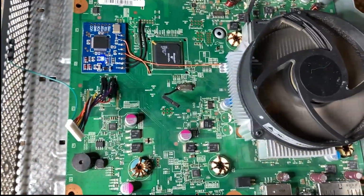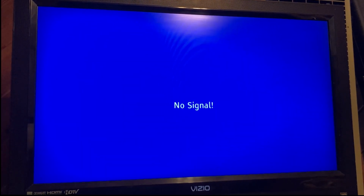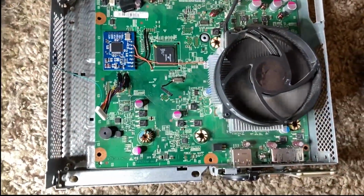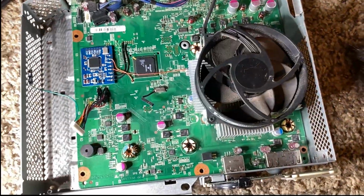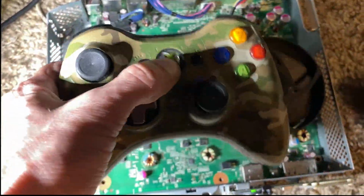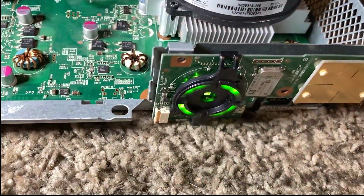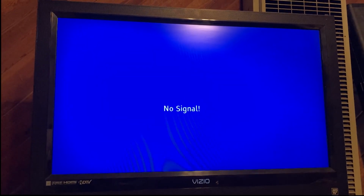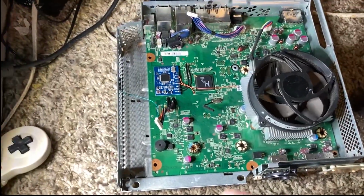On. Oh yeah, it's already gone. And there she is. So timing file 100 did the trick for me with the matrix, with the oscillator, on a 4 gig Corona. So let's try it again. Light, solid light. Oh, yep, already booting. 4 in a row. And if it's anything like the Trinity, we're just good to go.